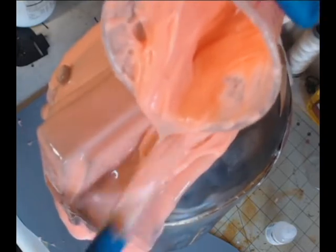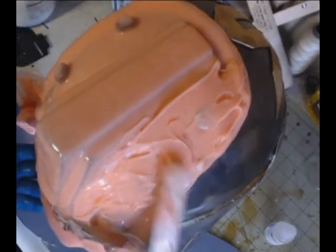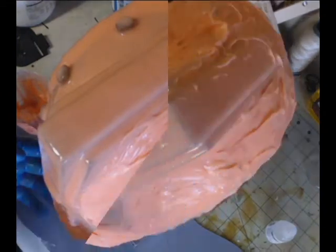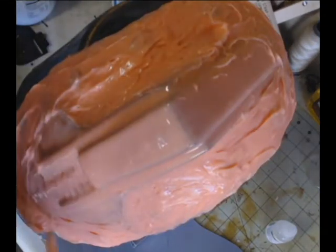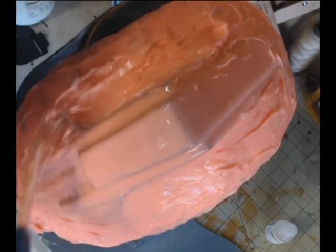This is when the silicone becomes what's known as trowelable. So you can take a mortar trowel and spread this stuff around. Now I'm just using, again, these wide craft sticks here, but it smooths it around. It moves really well. You can see the stuff does not run. So using it in a vertical application of this type is much easier. It does not run anywhere. And here we've got almost the entire mold covered with this thickened silicone.